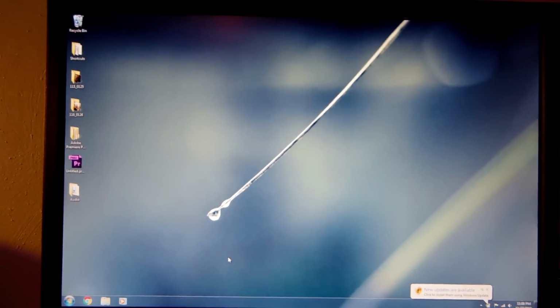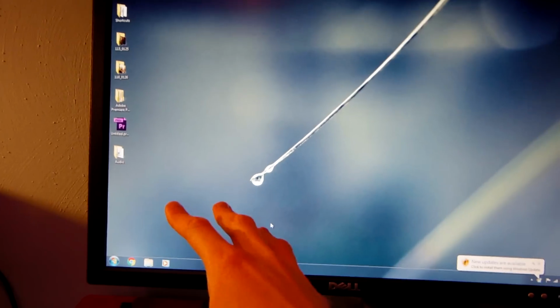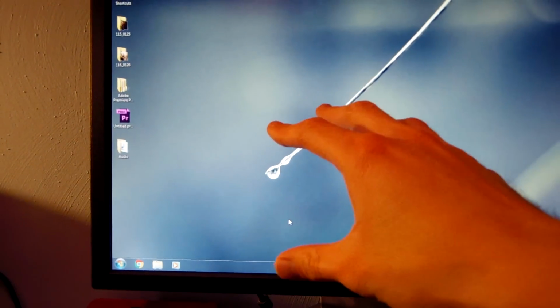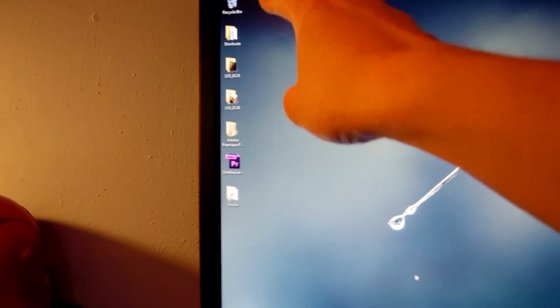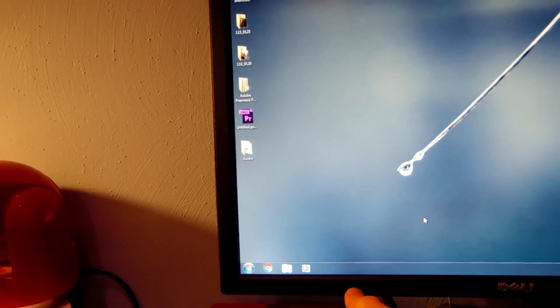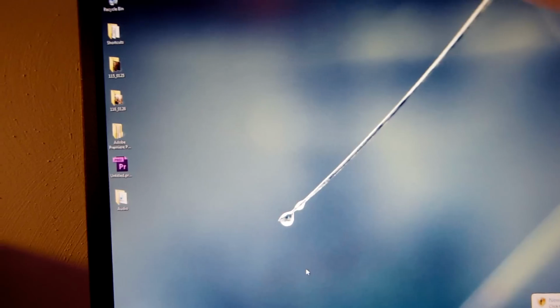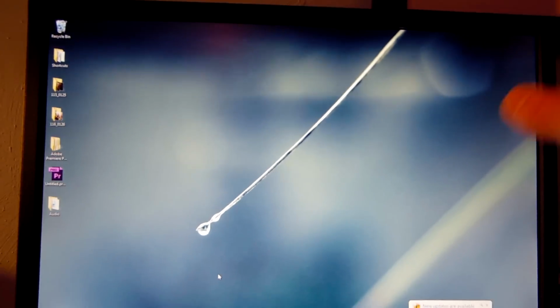After I went off camera, I did run into two problems. One, the wire wasn't sitting quite low enough below the actual metal shielding, so I couldn't close the monitor bezel all the way, so I had to do a little bit more drilling, and then even after that I had the wire run diagonally across down here. I don't remember exactly how I routed it, but it is making contact with the back of the bezel right here and the back of that metal shielding, so it was hard to close the monitor.